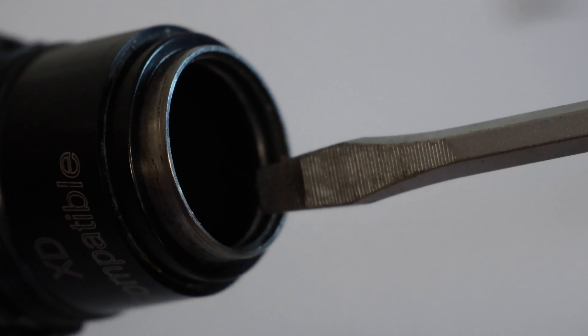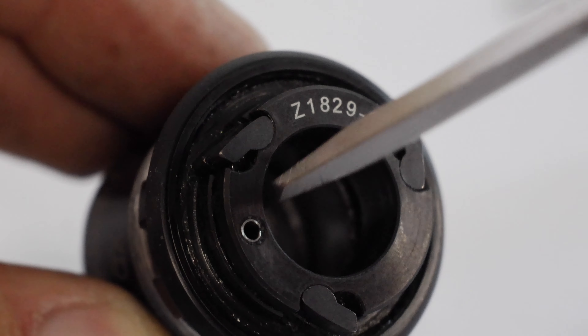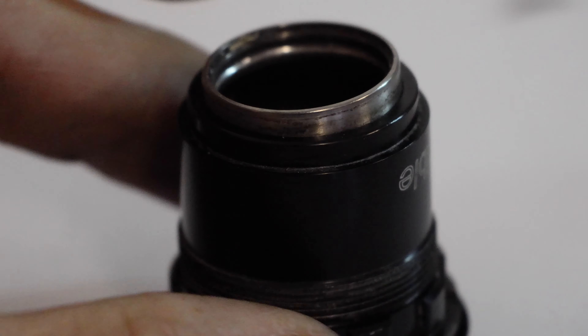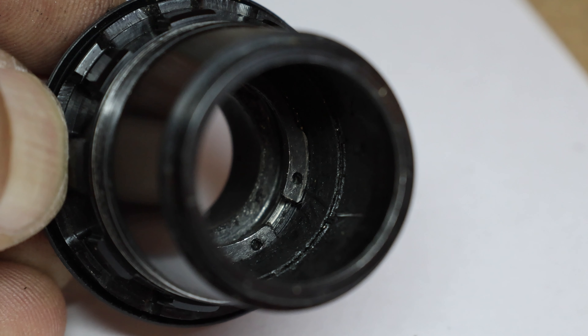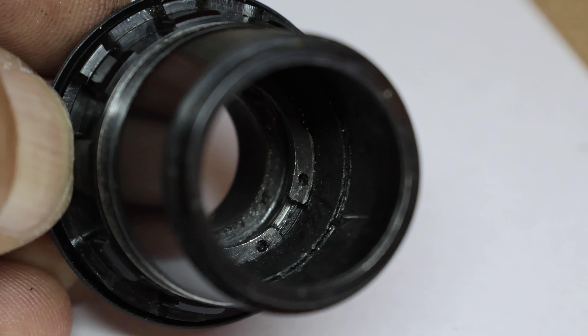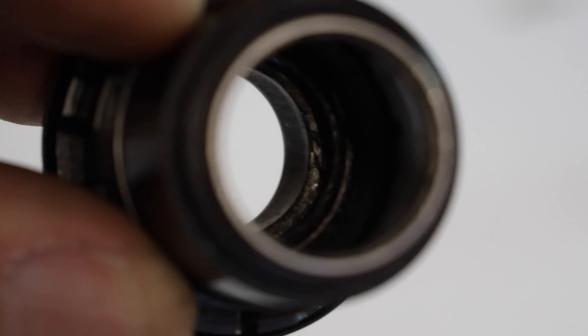This end bearing - the first bearing - needs to come out. It's normally seated in the hub down a fraction. We need to get in from the opposite end and tap it out, working your way around the outer bearing. Once it's out, we need to get the back bearing out which is right down there. There's a circlip behind the back bearing - use your circlip pliers to get that out before you can knock the outer case out. This back bearing has lost all its ball bearings too - we've only got the outer case. We've got just a tiny bit of edge to tap it through, and that back bearing has to travel all the way down through the body.